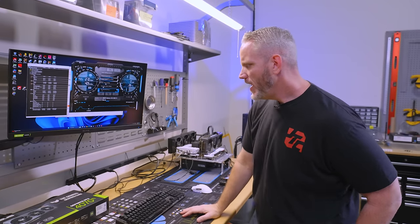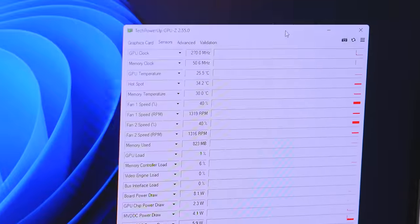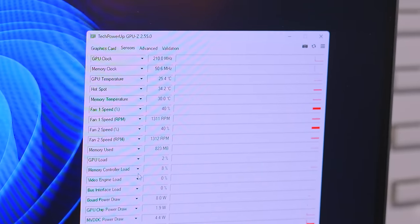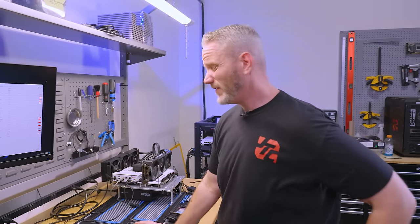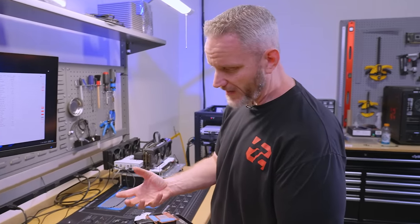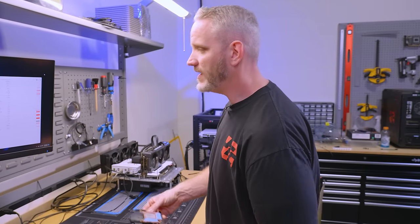What I don't have visibility on — and it really bothers me — I need to check GPU-Z to see if it has it: VRM temperatures. Even with the latest version of GPU-Z, I do not have voltage regulator temperatures. My main concern was whether just blowing air directly at the component with no heat sink on it will suffice. I guess technically it will, because that's exactly what we did with our XOC stuff — just blow a fan at exposed VRMs. However, a heat sink touching it would certainly be ideal.